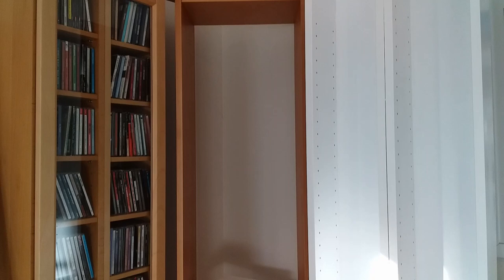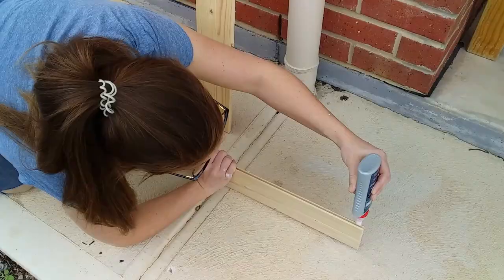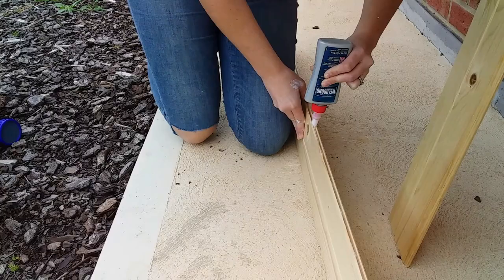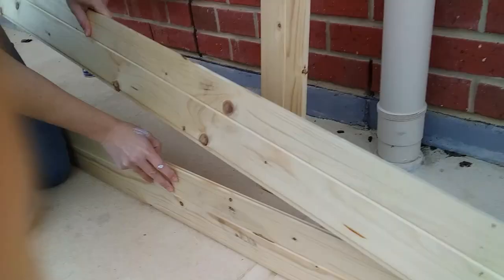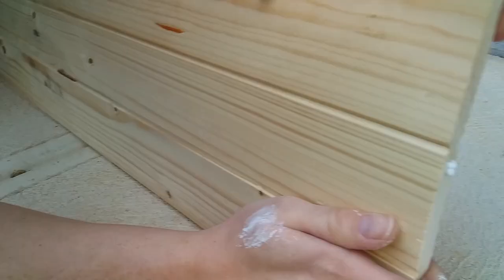It had started breaking off at the bottom, so I decided to replace it with some tongue and groove board, which gives the VJ panelling look. I bought one 6-metre long tongue and groove board, and they cut it to size for me in the shop. If you need them to be narrower, and your hardware store can't cut it lengthways for you, ask at your local school tech room if they would be willing to help you out.